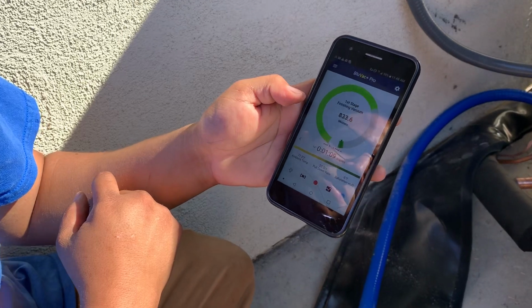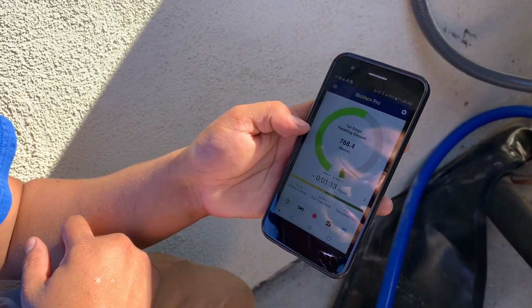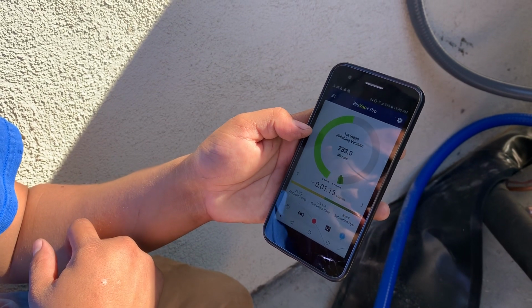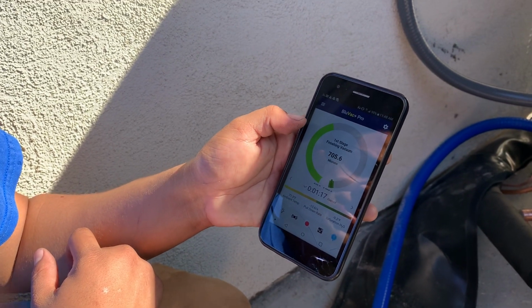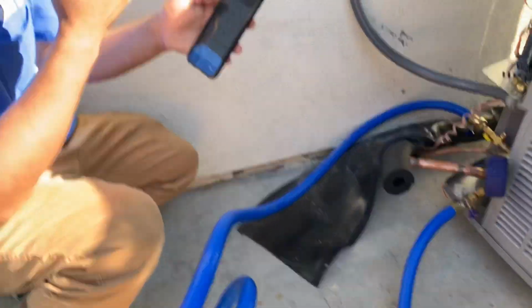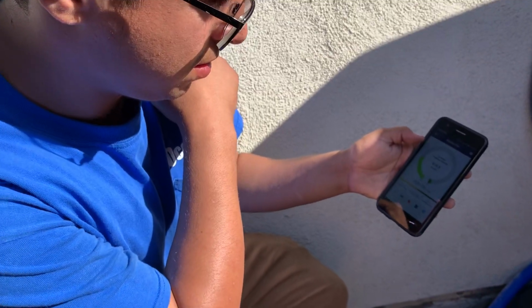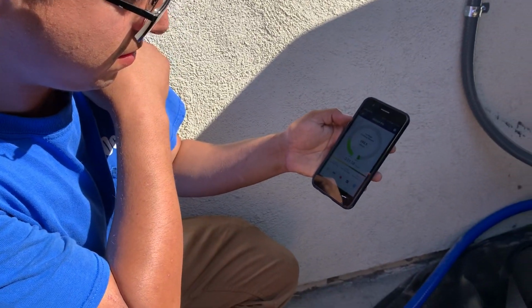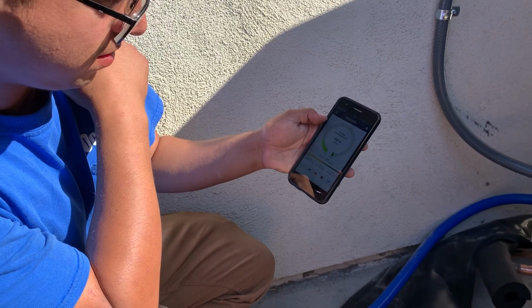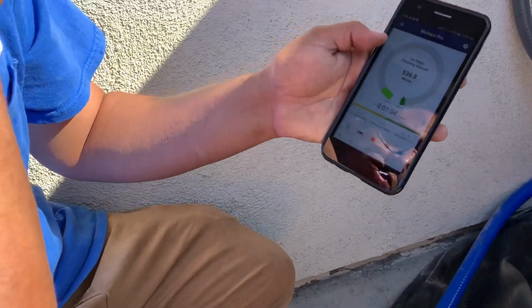You got your power saver thing on. Yeah, sorry, that's fine. It saves your battery. And you're going to try and get this down to 200? Yes, and then I'm going to isolate it. It's under 500 microns in less than 2 minutes.